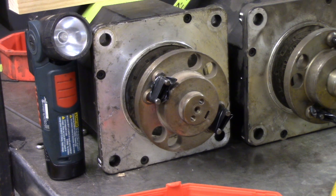There are some notes here. Danger: an incorrectly wired or configured motor may move violently or unpredictably when attempting move sync. Keep your body and others away from the motor when move syncing for the first time, and be prepared to hit the emergency stop button. Danger: large motors may have a tendency to oscillate violently during a move sync due to the nature of the current feedback loop. It is recommended that for 3 kW and larger motors, you adjust the motor's current to half of the recommended value in the current feedback menu while move syncing. After the encoder alignment process is complete, set the current back to the recommended setting.